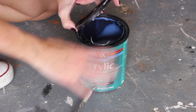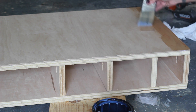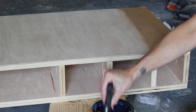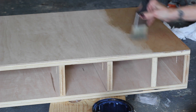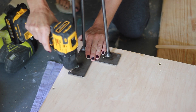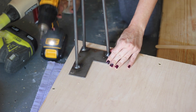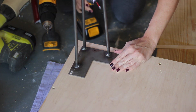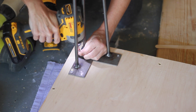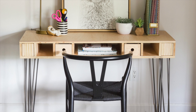I like the look of natural plywood, but you could always paint or stain it at this point. I decided to keep it natural and just sealed it with a polycrylic top coat. If you don't like the look of exposed plywood edge, you could use edge banding, but I like it so I'm keeping it exposed. Then I attached the hairpin legs, which I ordered from a company called DIY Hairpin Legs — I will link to them in the description box. I chose the raw steel three-rod hairpin legs at 25 inches height, and they come with a wax to apply which prevents rust. Then I flipped the whole thing over and that was it.